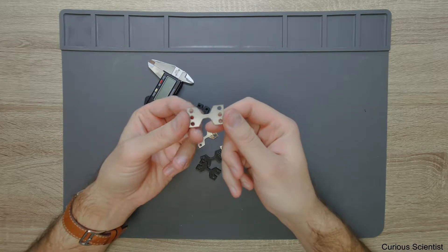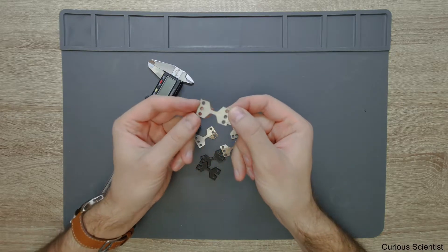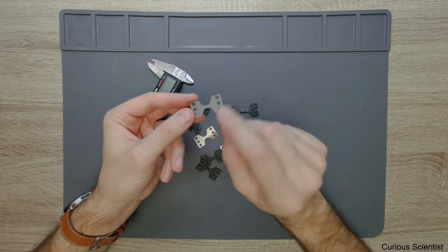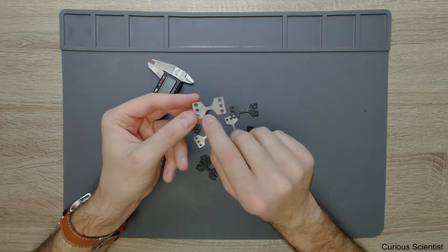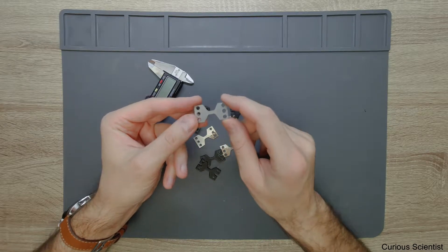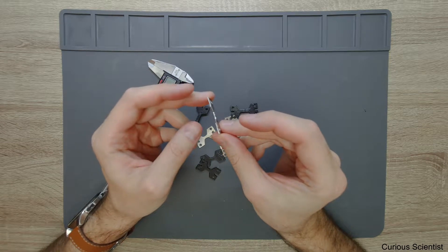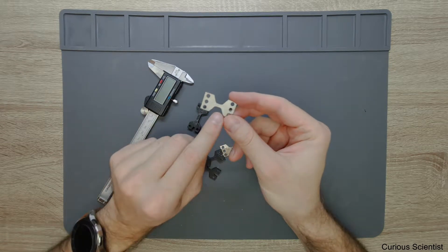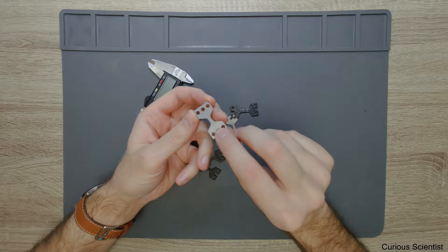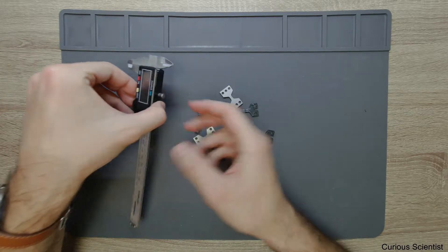The middle hole is just to let the screw go through it which clamps the grip on the tensile testing machine. It's a very small specimen. The length of it is like 34 mm, but what is more important is the parallel length. The parallel section in the middle is 5 mm, then this plate is 1 mm thick and the width of this area is 3.4 mm roughly — but we can actually measure it.